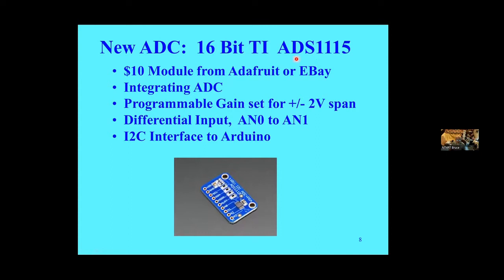With this, I can go to an exponential lookup table and have something that reads out directly proportional to temperature, which is what we actually do here. We went to a new ADC on this — a 16-bit converter. Ed Harfman worked with me a little bit on this one. I was hung on the idea that 12 bits is good enough and 16-bit costs more, but Ed had the idea that maybe we could eliminate the DC amplifier and some other components by using better accuracy and moving some functions to software.